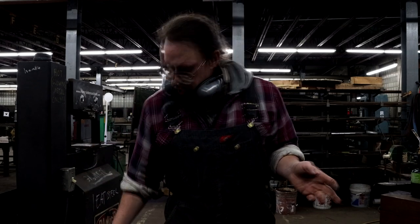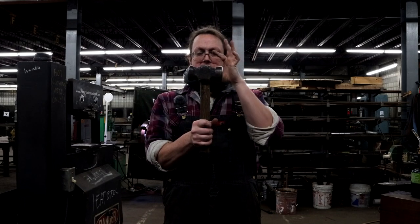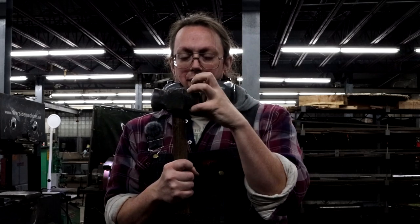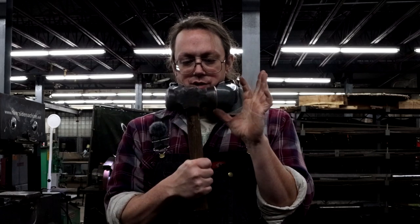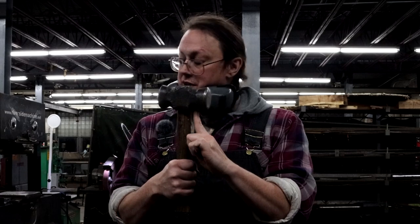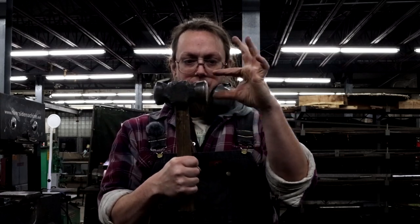I've never done a hammer like this. Normally when I do a hammer, I love doing these little grooves, because I think in some aspects it's to get more hammer face and more distance with less material. This space is empty, which means the hammer doesn't weigh an extra half pound. So it's great, but on this, because it's a raising hammer, I think I'm just gonna use the one-sided die to push these up flat with the top, and then I'll draw them out into nice little hammer wings.